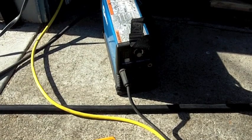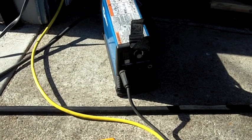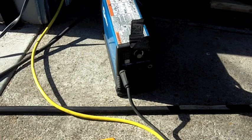So the plan of attack for all the welding for this tractor, I'm going to use the Miller Maxstar 150 STL. And this is fairly structural. Not the leak that I'm doing today per se, but the other cracks, at least the two others that I've identified in that loader frame, are all going to be welded with this Miller Maxstar 150 STL. I will be welding it at 240 volts, not using the 110. I'll show you my system for that.